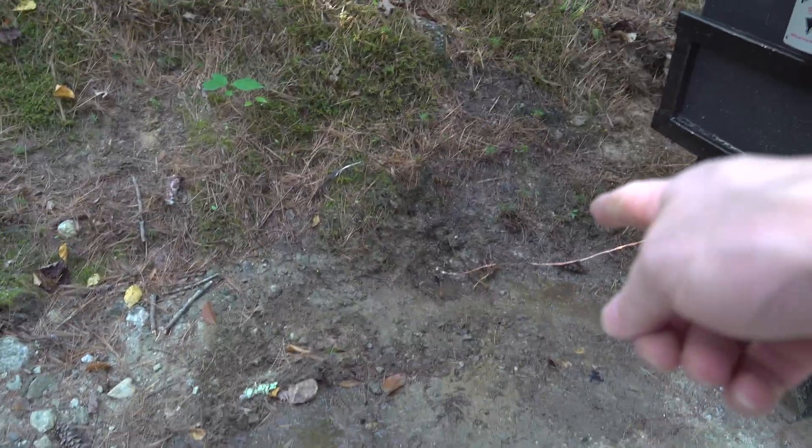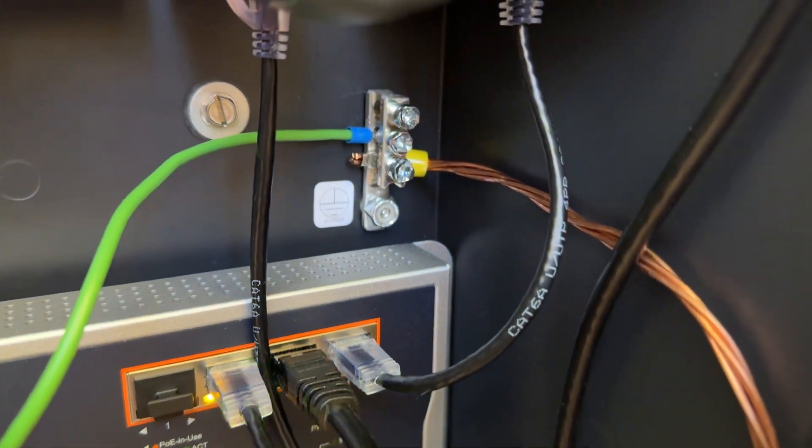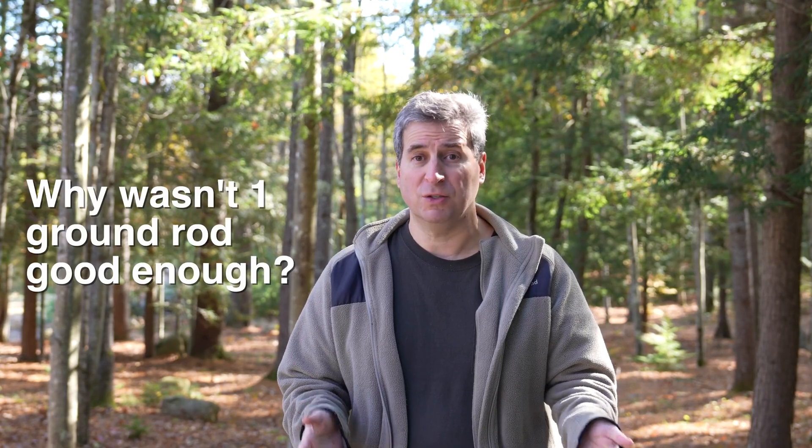You probably noticed this is a pretty thick wire — it was six-gauge. You're probably thinking how am I ever going to get that into one of those network protectors? The simple answer is you won't. You want to connect this wire to a ground bar, which is about five bucks. You can tie in your ground wire and then use smaller gauge wires to make that final connection. People will say ground clamps just don't fail and that I'm completely wrong. But the current electric code requires you to have two ground rods for a single house. Grounding rods do fail — they can wear out over time, and often they fail because of the clamp or the wire that connects to them. I'd much rather see the code require a welded ground rod connection. So as of today, I'm grounded. Hopefully my gear is going to be protected, and if you live in a lightning-prone area like I do, spending this little bit of money can really give you good protection. If you have any questions or comments, please leave them below, and subscribe to the Silver Symbol and the Workshop channel for more videos.